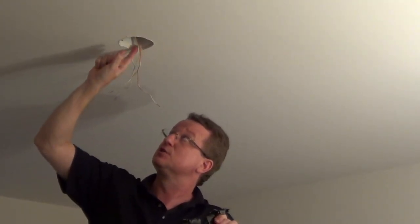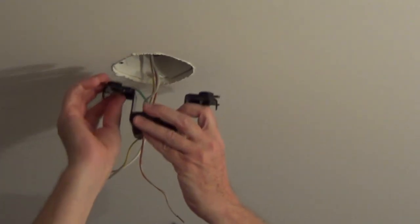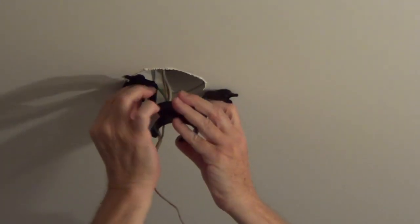You don't want to use these little folded ears on the corners of the box. You're going to use a threaded tube that's going to be much more secure. So we'll just take our screws and connect it to the box.